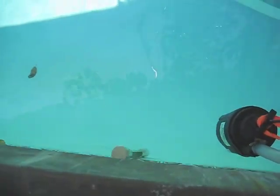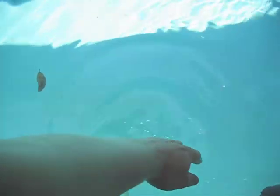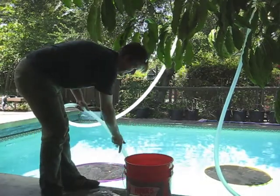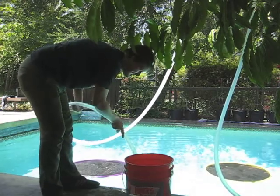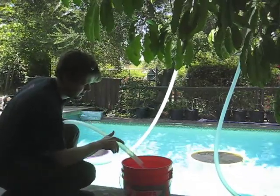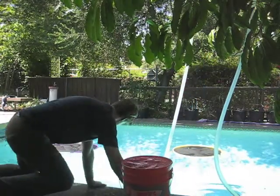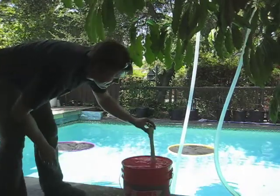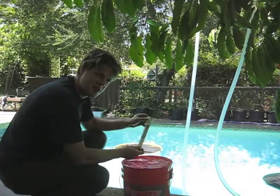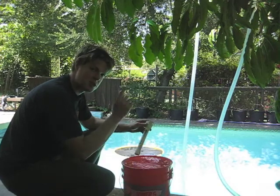The temperature of the pool right now is sitting at about 72 degrees. That's the input to our water heater. So let's see what the output is. Let's see how fast the water is actually flowing — I'm going to fill up this five-gallon bucket and see how long it takes. Now let's see how warm it is. Just leave that little thermometer in there. The temperature we have is about 79 and a half degrees. We'll use the flow rate and that temperature difference to compute just how much energy our solar water heater is putting into the pool.